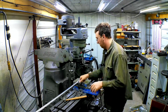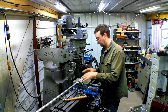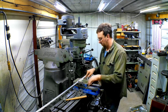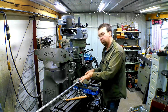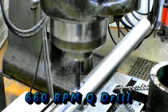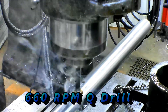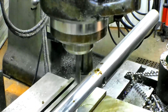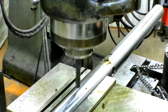Let me explain what I just did there. I put a tool bit in one of my broached holes and put a level on it — that'll tell me when I'm perfectly aligned to my square holes. Then I can drill them. When I get to the next one I'll have to move the tool bit and recheck the level, but then I can just use whichever hole I put it in moving forward.